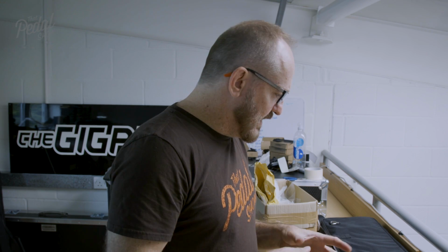So the other thing with the generator is that it's modular, so it connects to a distributor and that goes to high current adapters. When we started with just analog pedals, and we first started getting the bricks and those sorts of things, it was fine because we weren't drawing too much current and the transformers didn't have to be too big. But now in the modern digital world, where we have Strymon and Eventides and Providence and so many pedal companies doing amazing things, a lot of these digital pedals draw a lot more current to operate, and they need that current. If they don't get it, they don't sound right. So the all-in-one power supplies have had to become bigger, which is great.